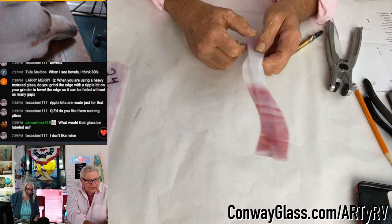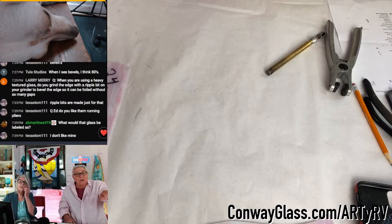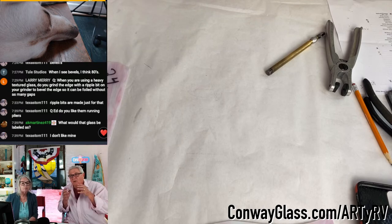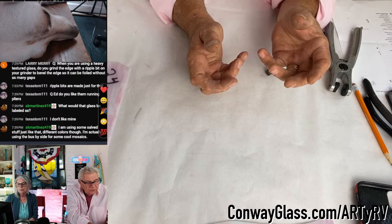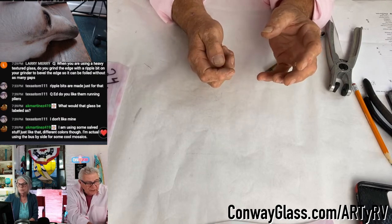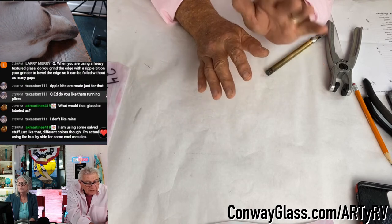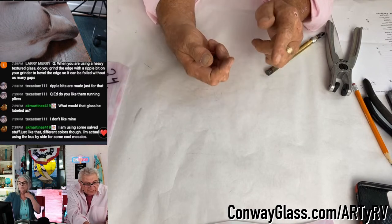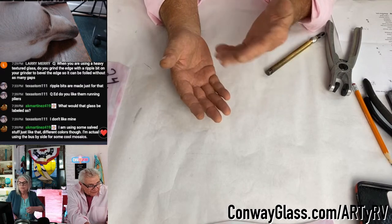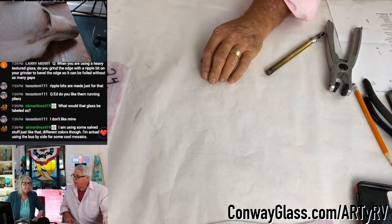But remember, when you're cutting textured glasses, they are going to be rolly on one side, rough, bumpy on the other, and sometimes you'll even run into a pothole. Don't lift up on your glass cutter, and I really can't say that enough. I probably say it too much. But drive out of that pothole, and then turn your glass around, break it from the hot end or the end you just finished on, and most of the time, y'all, your glass is going to break